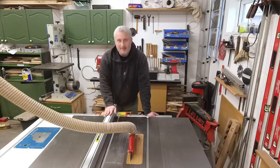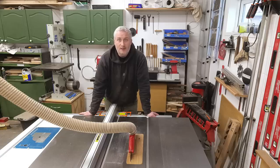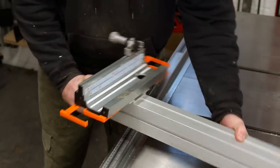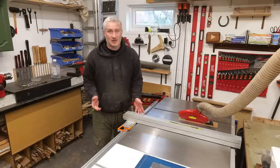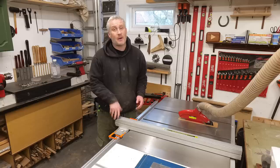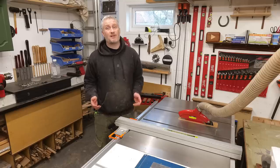The fourth issue is with the fence and getting it into alignment with the blade and table. When I lock it, it skews a little bit to the right each time. Adjustment is made via four allen key bolts, but in practice whenever you try and set it and then tighten the bolts, the fence shifts a little when you tighten them. The solution is a bit of a hack, suggested by Carl at Strawbite Workshop — adding some shims to the aluminium rails. Having just removed my old measuring tapes from the fence I thought, what the heck, it's worth a try, so I super glued two bits of tape onto the inside as shown. This seems to have completely resolved the issue — there's now no play when I slide the fence back and forth, though it is a little tight with some friction. I'm sure with a bit of use once the tape wears a little it'll be fine. Now when I lock the fence it aligns parallel to the blade every time — no more skewing. I'm well chuffed, especially as I was thinking about designing a whole new fence for this saw, and now I don't have to.